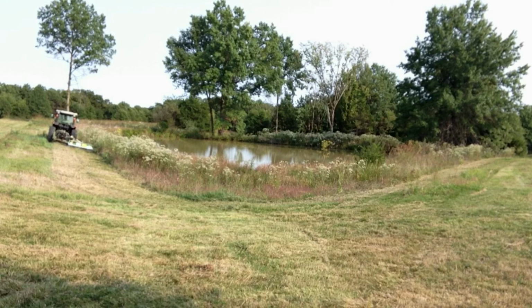I know some people have been commenting that other flail mowers tend to get jerky. This one, like I say, doesn't, just the up and down on the 3-point. I don't even see it here, but there's a knob I could turn and probably slow that down a little bit. Well, I'll make sure that angle relaxes a little bit more down, so it follows the contour of the bank.